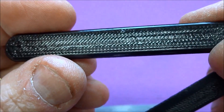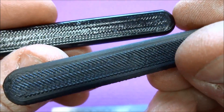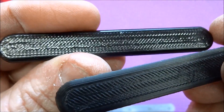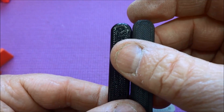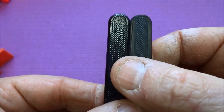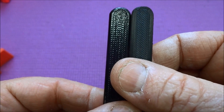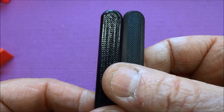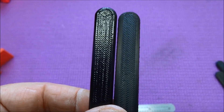You can still see some remnants, and although it's much nicer than the original part, I'm thinking if we give it a little bit more time. I've calculated that at the end of 30 seconds, all of our acetone was gone. So now I'm going to try one minute — and in order to have enough acetone for a minute, I'll need about 35 cc's. Let's go ahead and try another part.